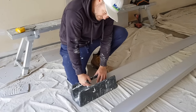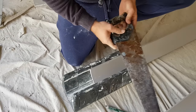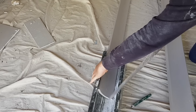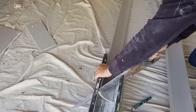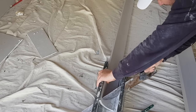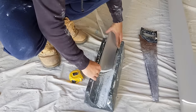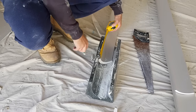Come a bit over here so you'll be looking at something like that. To get a neater cut, come around this side and just cut from this side — just don't let that confuse you. So we're cutting one right. Here's your right internal. If you're working by yourself and you need to measure, put it to about there, stick your tape measure in there, and we need 2980.